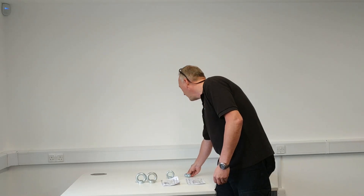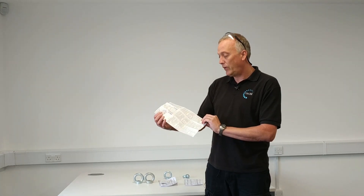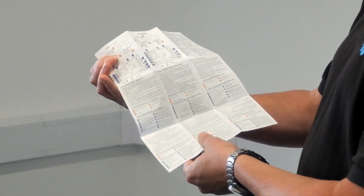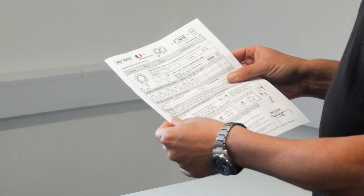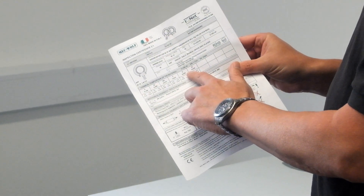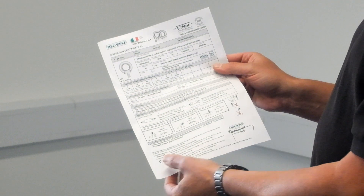Both these products come with a safe use data sheet. Here's the full data sheet that comes with them, with all the standard angles and instructions for use translated into pretty much every language. The most important part of all: they come with an EC declaration — this is the manufacturer's inspection certificate. It shows the standard they're made to, the maker's mark, the material composition of the actual eye bolt or eye nut with all the chemical breakdown of material, and all the angles of test. It's signed off by the company and there's a CE declaration there.